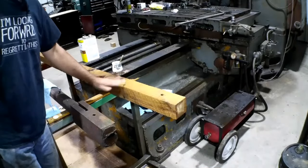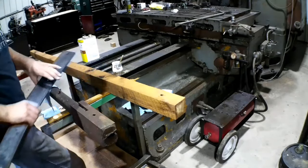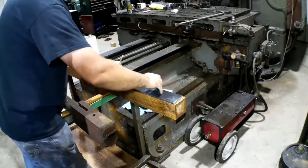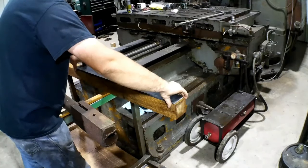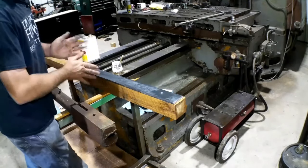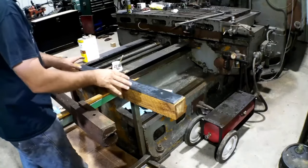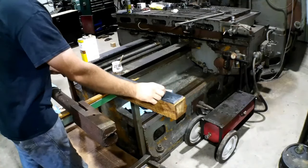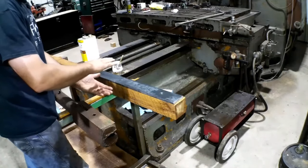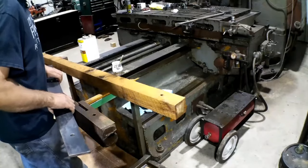This is just the first coat of linseed oil — it's not soaked all the way through but it is soaking in and looking really good, coming out pretty. Here's my plate lined up with the hole that's already drilled — one on either side — then I drill through and use a threaded rod with square nuts so it looks right. The square nut on each side clamps it together, giving rigidity and strength so it won't pull out of the wood when you're pulling hard. I'm going to soak this up with another coat and get started on the next pieces.